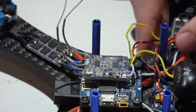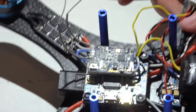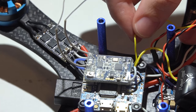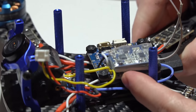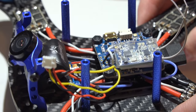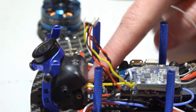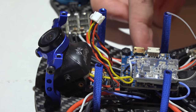I won't be using telemetry. The Omnibus F4 board doesn't have the hardware required to invert signals for the UARTs - it does have one inverter for the SBus signal. I really don't care about telemetry because I use an on-screen display. For the built-in OSD, I wired in my video wire from the camera and video transmitter. I'm not using power and ground pins on the flight controller for OSD - I use power and ground from the LC filter, or you can get it right from the PDB.